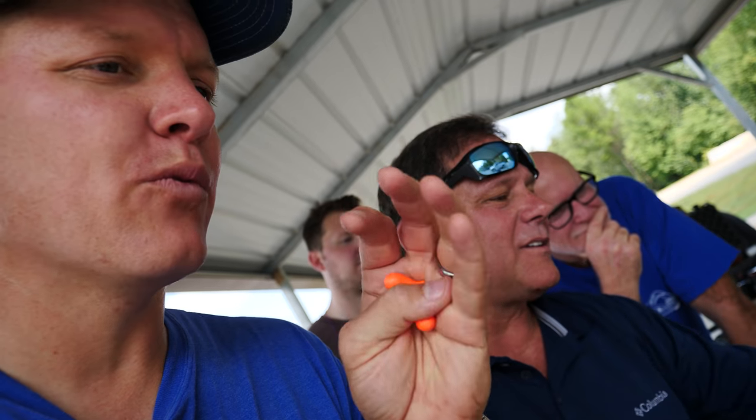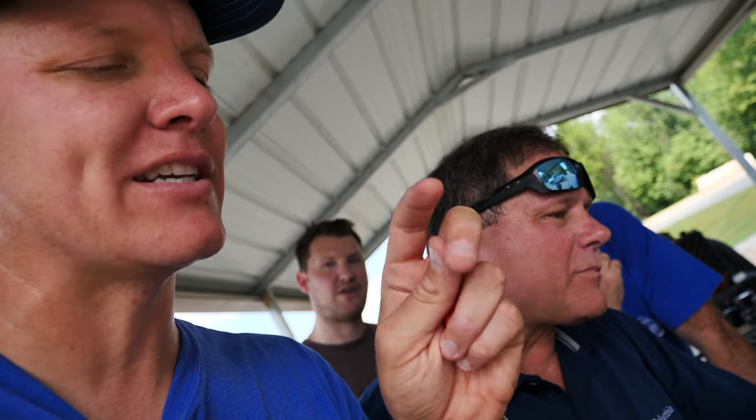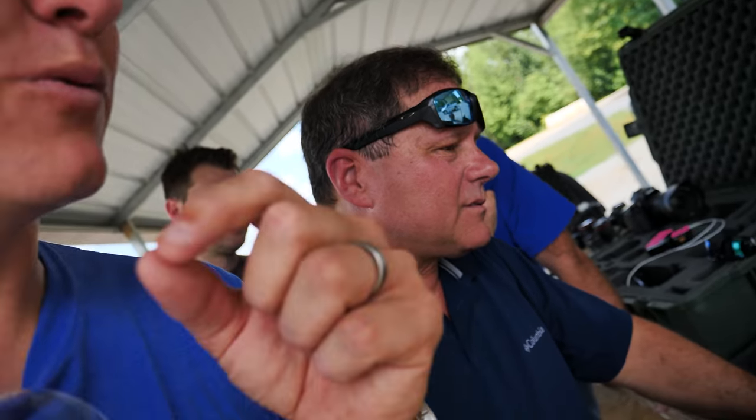Well, I mean, it's acrylic. We know. We accomplished what we wanted to do at that point. We wanted to see what happened to the gases inside the acrylic tube. The fact that it came off had to do with axial stress. Once it pressurized that tube, it's pulling the whole can, and those threads just couldn't handle that. That's right. So we did what we wanted.